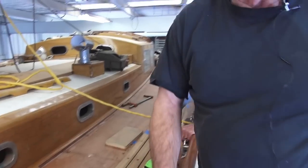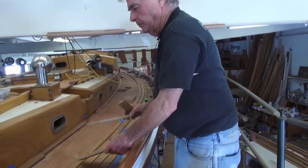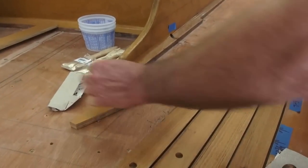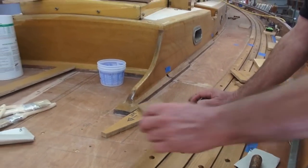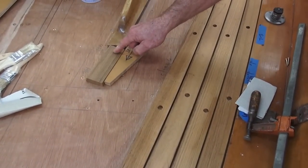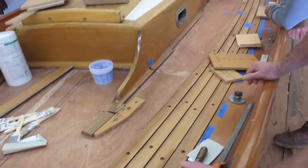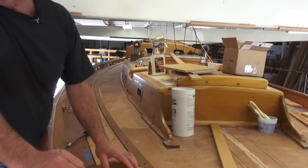Now up here, this will work. You see this plank here that's going to be coming in this way? Number seven. This one, come in there. And just because of the way this is, this will be a regular plank. This one will have a notch in it. Now, you're laying teak deck, so you've got to keep thinking about five or six moves ahead. Like playing chess.